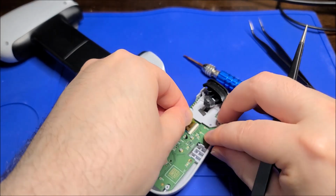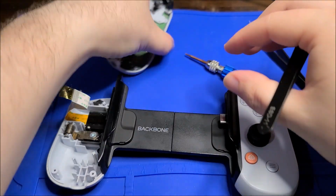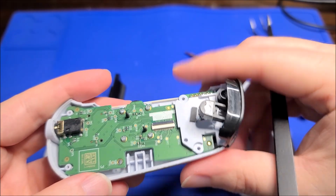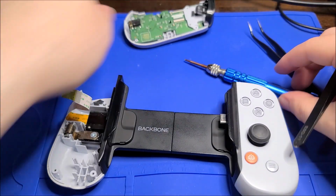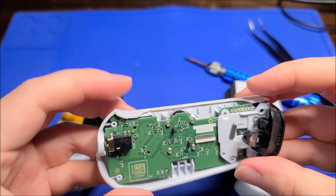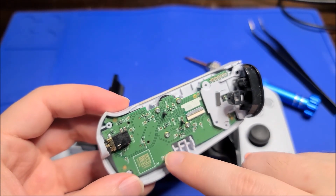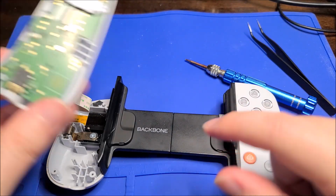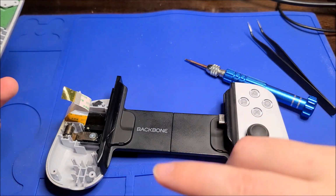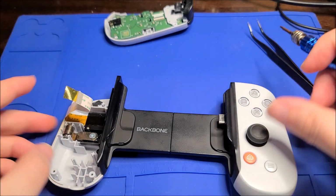So yeah, there's obviously a connector going. Let's see, does this have how many pins? No, it's just labeled J1. It looks like a good 20 to 30 pins going between the two sides. So I wonder, at least on this side, I don't see any microprocessing going on. So I don't think this is a serial communication thing. I think they literally are just passing all the signals through that ribbon. So obviously if there's a connection issue with the ribbon, then certain buttons can drop out.